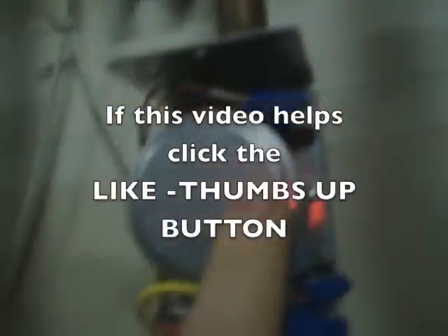Next, I removed this cover. I knew this zone valve was working. I went inside and turned this thermostat all the way down so that this system would not turn on. So both of these have the system turned all the way down and I don't have to worry about them coming on. I took off this motor — I knew it was working — and I switched the motors. I put the known working motor in here, and the motor I was still unsure about into the other system. Tightened both back down so the wires were good. Went inside and turned the thermostats up. This thermostat with the new motor kicked back on — no issues, it turned on and started working just fine. So right off the bat, I knew that was not a motor issue. The other system had the same problem — did not turn on. So I still know I have a working motor in there, but the system's not turning on, so I have to figure out what's going on next.